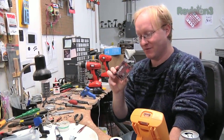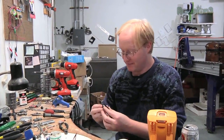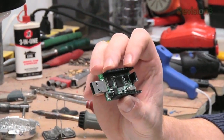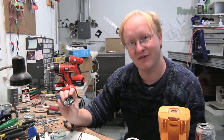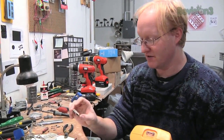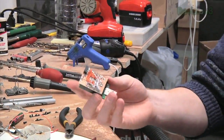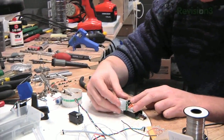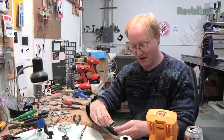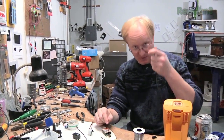The chip kit that was damaged had some more problems, so I got this little development board that my friend the Longhorn Engineer made. It uses a Propeller chip and you can plug it right into your computer's USB port, program it, and it has all the pinouts. I made a little shield for it that has two H-bridge motor drivers so we can drive our stepper motors. The shield is small and compact, and we can bolt the motion sensor right on as well. USB only has 500 milliamps of power available, so it's not enough to drive two separate motors, but a separate power supply can handle it.